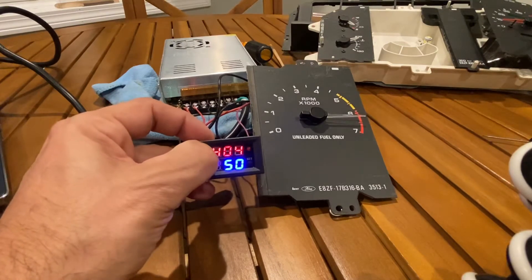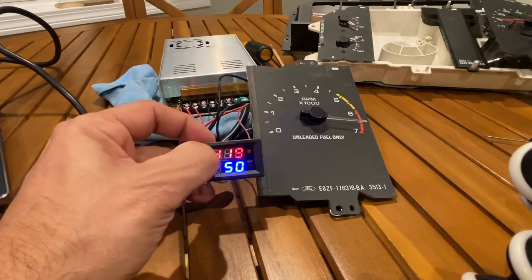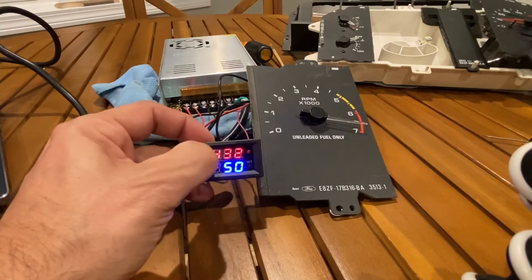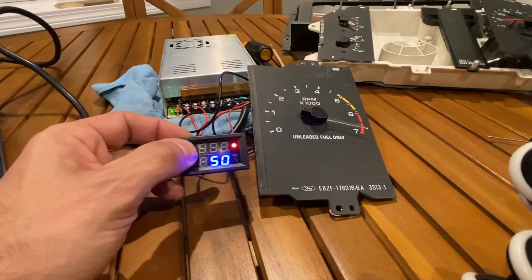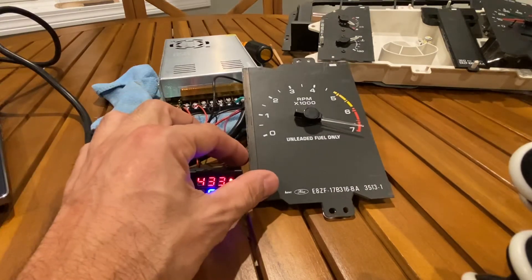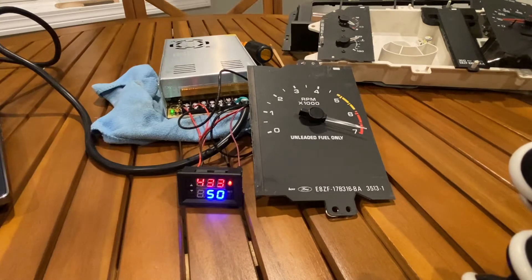As you make big leaps it'll pause, but once you release it'll jump to that frequency. Going to 433 — and this is where it'll make you pull your hair out — because it was accurate at 5,000 RPM, but at 433 Hz we're reading nearly 7,000 RPM when we should be at 6,500.